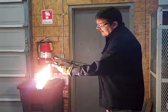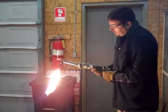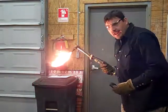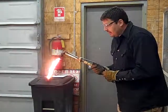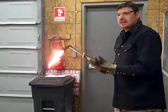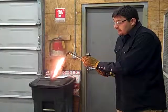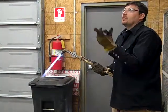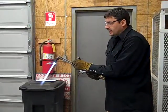If that's a little high — see that gap right there? That means it's a little too high, so we're going to turn it where the flame comes right out of the torch. If it's whispering real loud, it's too high. See that black soot coming up? That's unburned acetylene. The fuel's not being burnt completely. So if we add oxygen, the smoke goes away — we're utilizing all the fuel, it's burning completely.